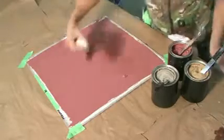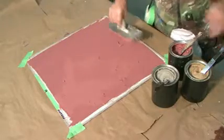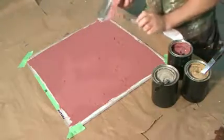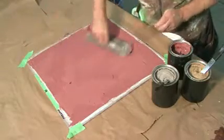When the first coat has fully dried, we recoat the entire area with the same color, but only partially. Only cover an area you can finish completely before moving on. We recommend no more than 4 to 8 square feet to start.